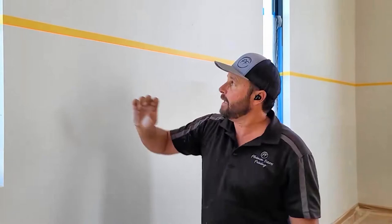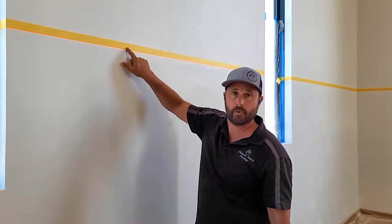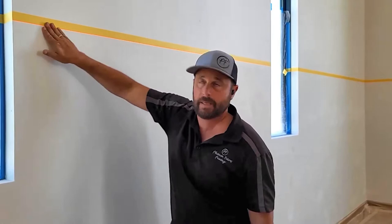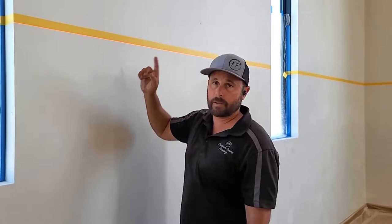Today we're using frog tape. We're gonna take a little bit of a damp rag, and right before we shoot, we're gonna wipe a damp rag that'll activate the moisture lock in this tape. It's kind of built for that. The paint will do it too. We're gonna take a very lightly damp rag, and we're gonna really push in our tape. And when I come up and spray this, we're gonna lay it off in that line. As soon as we're done with that, we're gonna pull it, all right? So we'll tune in when we're starting to shoot.